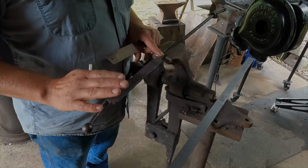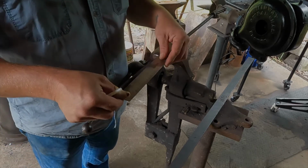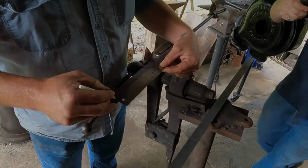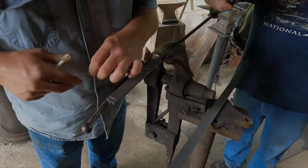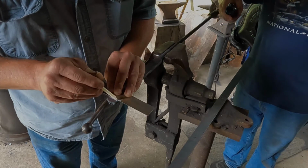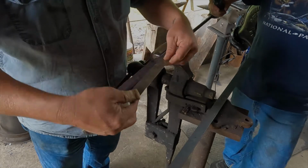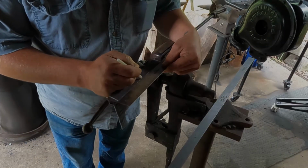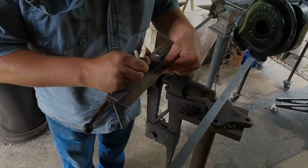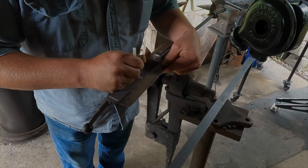We've got our cable forge welded together. We've got it in the vise. We're going to mark it out to clean the end off. So in other words, cut it off square on the end. So first I'll mark that. And then we're just going to cut it in half lengthwise. And I'm actually going to make a cut, not quite all the way through, but most of the way through the material, right on either side of that center mark.